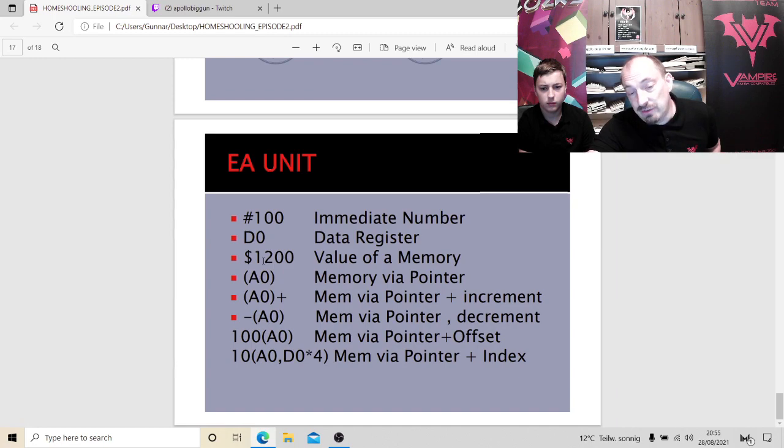You can always, in every instruction, work with memory. This points here to the memory address hex 1200. So this would be a part of the chip memory, in the first part of the chip memory. And you might have a pixel there, something stored which you show on the screen. You might have some sprite information there, or maybe some audio volume, voice, something you play and listen to. But it could also be gaming data. It could be hit points, it could be high scores, it could be the number of the magic item you just picked up in the dungeon.